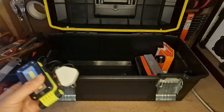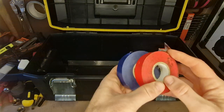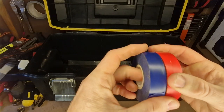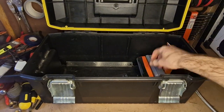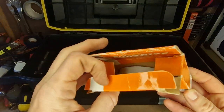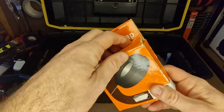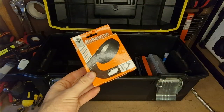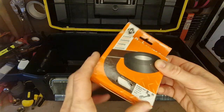Keep some electrical tape — I tend to mark up pipes with this so I don't lose track of which pipe is which. I mark up the hot and cold and yeah it seems to work well. This is amalgamating tape — if you want to fix a leak temporarily, this is good stuff. It works a bit like a tennis racket handle tape. Just put this around and overlap it a few times and it will stop a leak in a pipe really well, giving you time to get what you need. Good for a quick emergency — well worth having for any homeowner or tradesman.